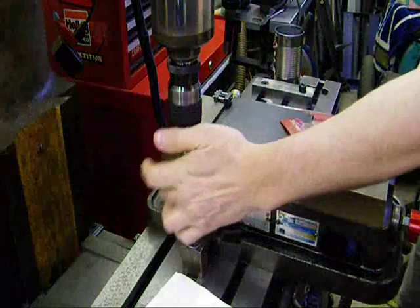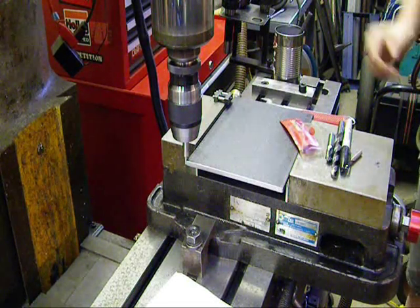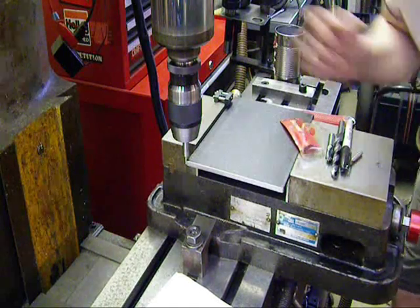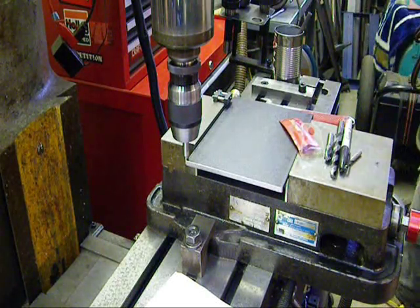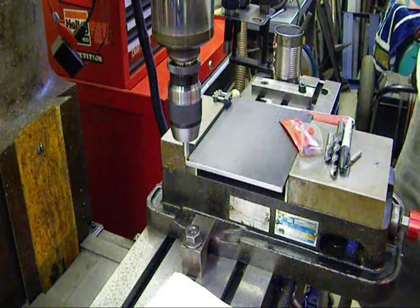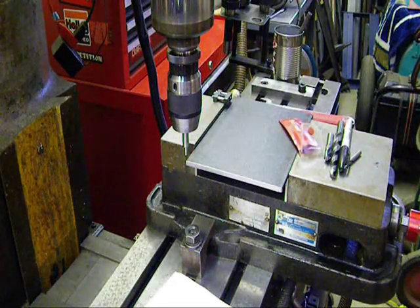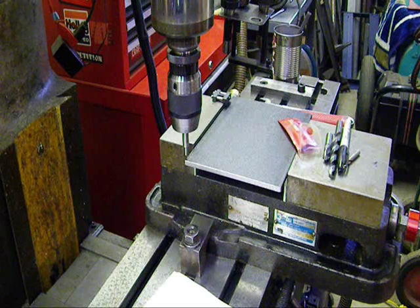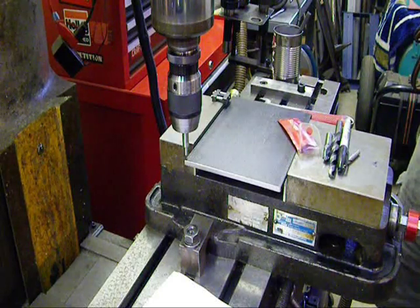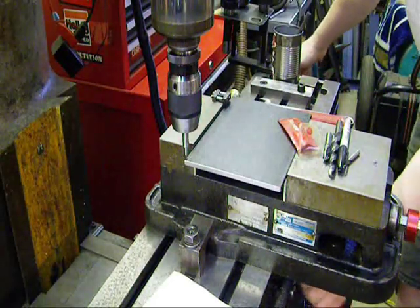Put your readouts on. Come up, come in a hundred thousandths, because the end of the tool is two hundred thousandths, so you want to come in halfway. I'm looking at my digital readout now. Clear that, zero that out — the Y is now set, this edge is now at zero. I'll do the same for the other edge.